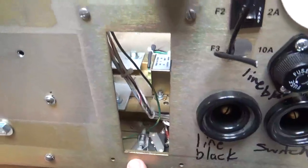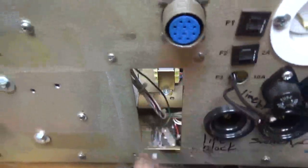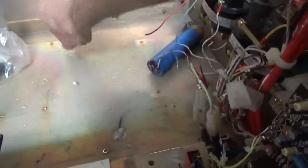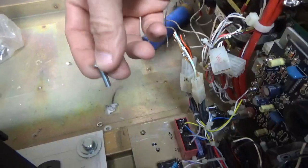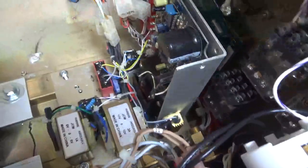This is an interlock — it opens up the plate supply if that assembly is off. Just left the other fuse holder; I haven't done that yet. You see the split washer, then the other washer. The supports in here already have a nut pressed in, so easy peasy — one there, one over there, one over there, one over there. This allows access to everything over here if need be.